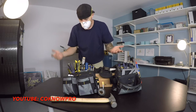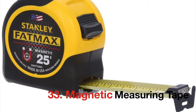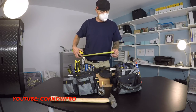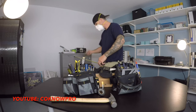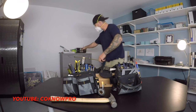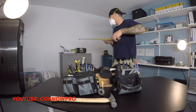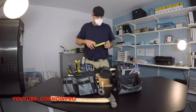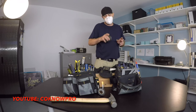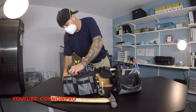Last but not least, the measuring tape. What I love about this one is it has a magnetic tip — I can go hands-free and measure 51 inches without touching the end. For steel stud framing, you can run it to one side of the stud wall and pull your layout off it. Don't buy a cheap one — make sure it's a good quality brand.